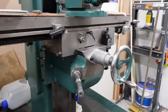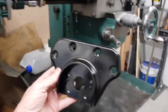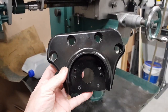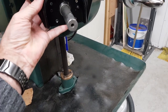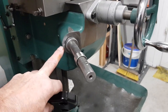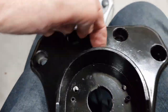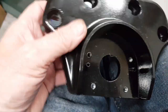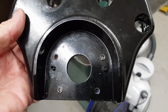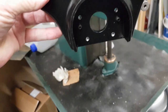you've got what comes with it, and I'm not sure yet whether I'm going to use it, but it is a nice thing. This is meant to go as an X-axis drive, that's what it's for, and I'm using it for Z. So I was thinking of boring the hole in the centre a bit bigger so it'll go over that collar, and milling somehow this out here all the way around, leaving just that as my fixing. I could then drill maybe 3 5mm holes and counterbore them into there, and then fix that onto there.